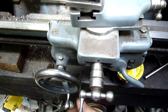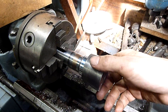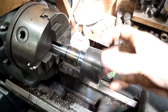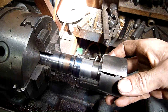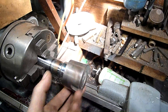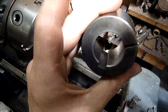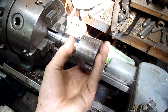The dials on this machine are imperial, and the ones on the turret lathe — they might be metric but they're almost completely illegible. They don't work; they just sit there and free spin because they aren't grub screwed to the shafts. Until I get around to putting the Heidenhain DRO on the turret lathe, this is basically what I'm doing — which is actually pretty good considering how worn out that machine is. It's done a lot of work since 1938. The bush needs a clean but that'll do — time to fit it up.